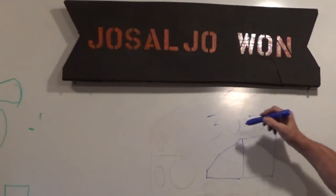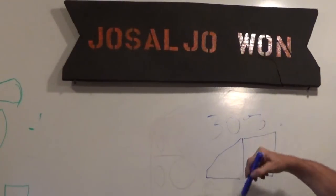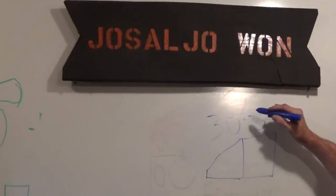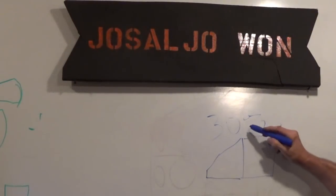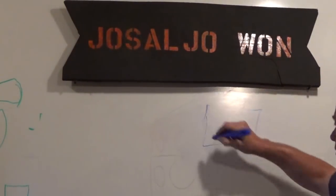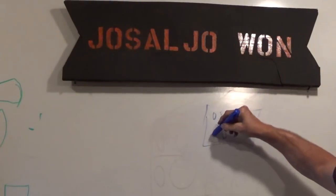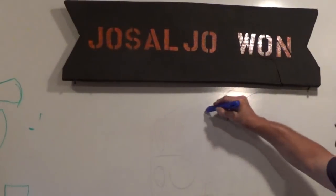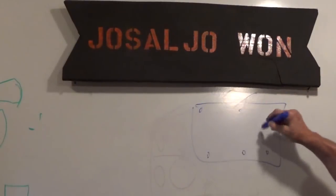In order to lower relative humidity, because I want it around 30%, and it's normally higher than that, very seldom is it a lot lower than that. It's normally higher in this area. So I'm going to talk about higher. So if the relative humidity outside is higher than 30%, and it's causing the inside of my kiln in the morning when it first starts to be higher than 30%, I can do one of two things. I can either extract the moisture out of that cube of air by using a dehumidifier, or I can make the air molecules separate themselves and give me more space to absorb more water.